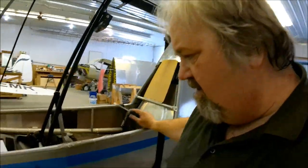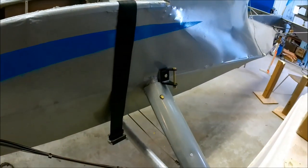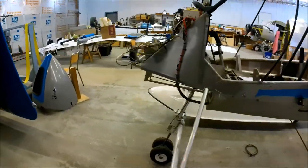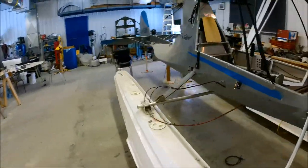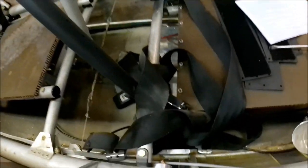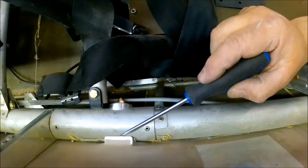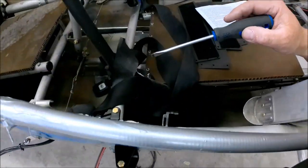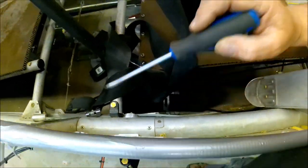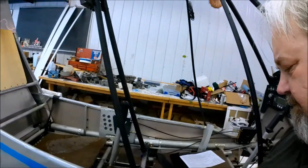And again, the Roni brackets. Let's take a step back here. The Roni brackets are on now with the distribution plate, on all sides. Let me show you — I think this is probably a better angle. Pardon the shaky camera, I've got to fire the cameraman. On the inside, of course, you've got the other washer that's curved, and then it's bolted on there. Here's the top of the Roni bracket from that side. That's supposed to help distribute the load on this bracket to prevent that cracking from occurring.